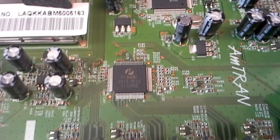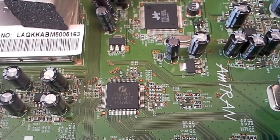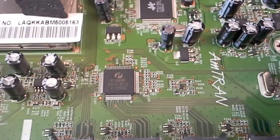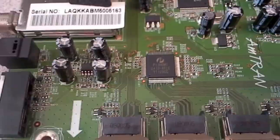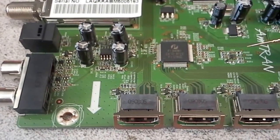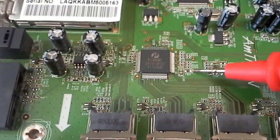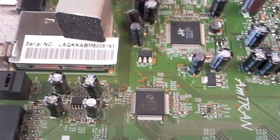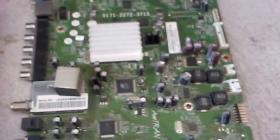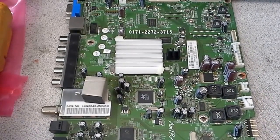You can find that chip in different places — at our website, or probably on eBay. We're going to replace that chip and hope it fixes the HDMI. Sometimes there may be additional smaller problems, but the good thing is there is no low resistance on the outside — and by low I mean 100 ohms and below, or even 200 and below. If there is low resistance on the outside, you've got a bigger problem that I currently cannot give you a solution for. Hope that helped — please leave a short review if it did, and good luck in your repairs.